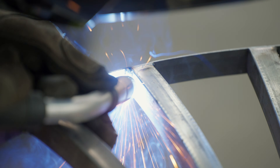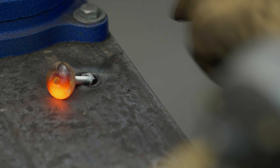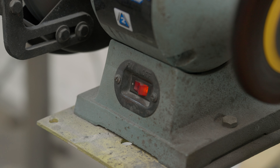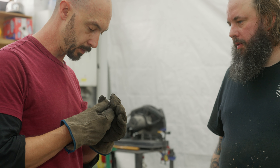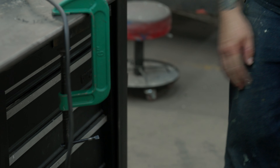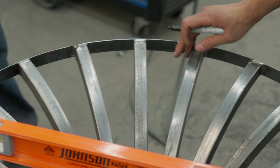Something I definitely wanted to include on these table legs were adjustable feet. I'm sure you've experienced the wobbly table at bars — nine out of ten times there are no adjustable feet, so you just grab a couple of drink coasters and MacGyver a janky way to keep the table from wobbling. For the dining room table, we made the feet by welding a quarter-twenty nut to a washer. Once welded, we welded the washer to the pedestal base so that we had a thread for our feet, allowing it to be adjustable.